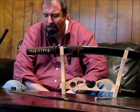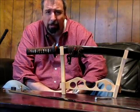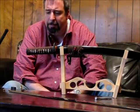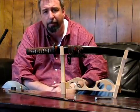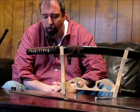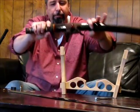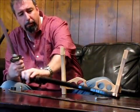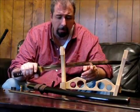But to make a really good tough sword, all we really need is a good spring steel. A medium carbon steel like 1050, 1060, 1070 steel. And you get 1050, 1060, 1070 steel with that carbon content, and you can harden a blade acceptably to take a good edge, to meet a good spring temper, where it'll be a nice tough sword. And so that's what we're looking at with our Ronin Dojo Pro Katana. We've got a nice good tough 1060 blade, through hardened, very tough, very sharp.